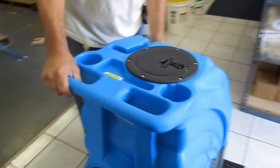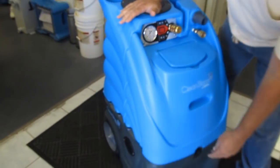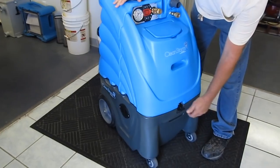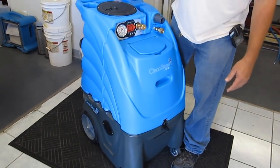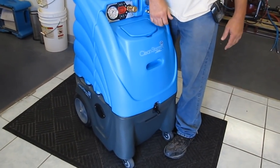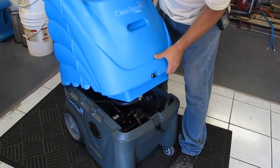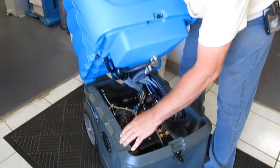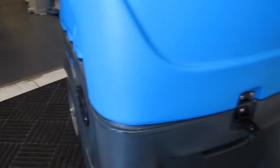I want to show you how easy this machine is — this is a very smart mold design for the housings. That's it to clamp and unclamp it, to lock and unlock it. Very simple: you don't need tools, you don't need to lay on your back to line it back up. You'll also notice that the mating surfaces at the bottom and the top are beveled, so when you close it, it's solid and locked in before you even throw the clasp, without all that energy being absorbed by the hinges in the back.